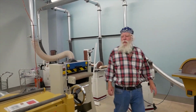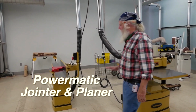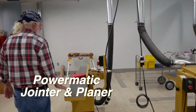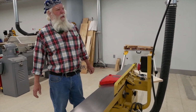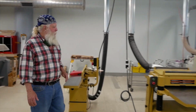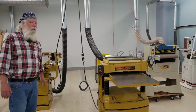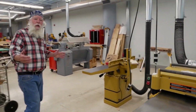As you convert your materials, we have both the jointers so that you can flatten a board that's got a twist in it. You can trim the edges to get a nice edge, again, to take that over to the table saw so you get square edges. And a surface planer. The surface planer is great for getting your material down to the size that you need. And these are heavy industrial machines, a lot of room to work with.